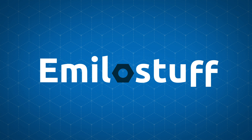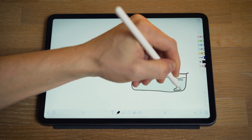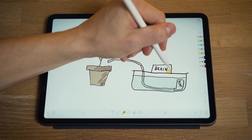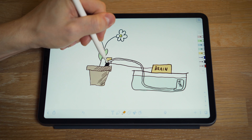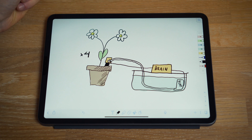So let's get going. Here's a quick rundown of the plan. The system will be built around a fairly large plastic container that'll hold the water. I'll place the pumps in the container and then run tubes up through the lid and straight to the plants. On top of the lid there'll be a little box with all the electronics — that's basically the brain of the system. From here I'll run a wire to a soil moisture sensor on every plant so we can see how well they're doing. The sensor will also hold the tube, which is a really neat solution. Of course, the pumps will also be connected to the control box. All in all, this system can support up to four plants.